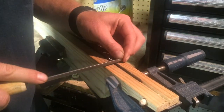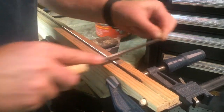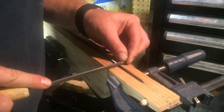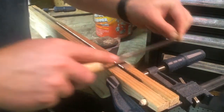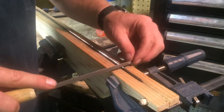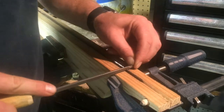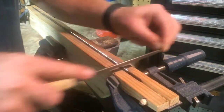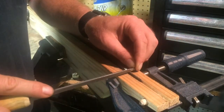Welcome back — we're about 10, maybe 15 minutes later here, and if it's 15 it's only because I had to stop a couple of times; my arm got tired. If you look down the length of the saw, you can see how it's all very shiny — a pretty good indicator that you've got all the teeth. You can stand back and kind of look down it just to make sure you haven't missed any. Not that missing one tooth is going to be a showstopper, but if you're going to take the time to do this, you might as well do it right.